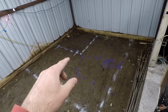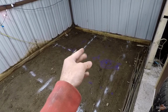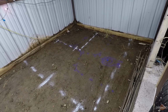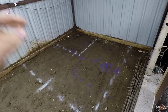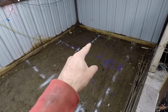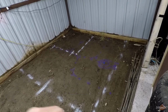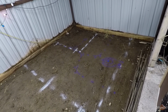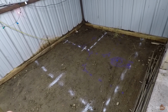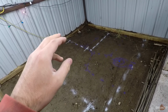And then we have another bend in that main where we're going to have the shower drain. I marked the shower drain to be kind of close to this wall of the shower, but now I'm thinking about putting it in the middle, and I don't really know. If I put it in the middle, all the sides of the shower will be the same height, right? And then it's going to all slope into that shower drain. But if I have it on the edge of this wall, we're going to have a nice slope on the walls where I'll be able to easily see the slope when I'm putting what do they call it? A dry pack or something like that, right? It's like a real loose, kind of dry pack of concrete that you're able to make that slope with. It'll be a lot easier to visualize on the wall as I'm going, right?